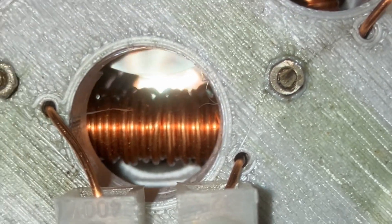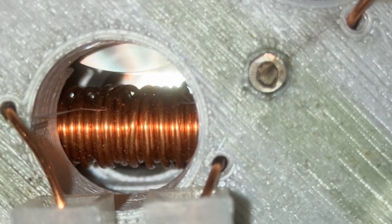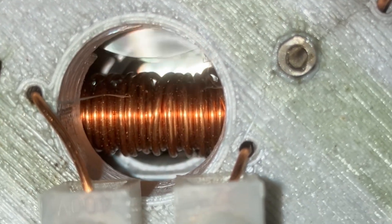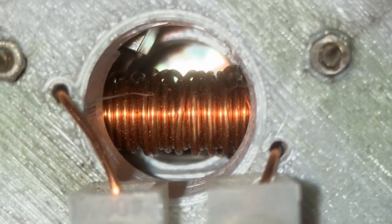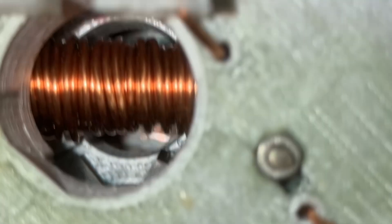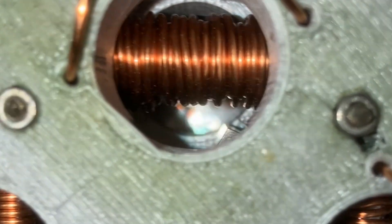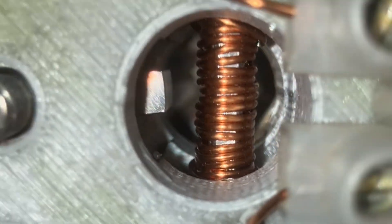The holes in the alternator housing were to allow air cooling, but there may be a significant RPM and power loss due to turbulence and air resistance. The plan is to make covers for the holes and see if there is an improvement. Since the housing is 3D printed in PLA plastic, I will add a temperature probe to monitor the temperature and try to avoid melting the housing. The test was successful enough for me to go ahead and start making the alternator power supply control circuits.